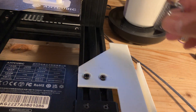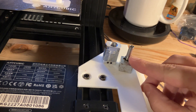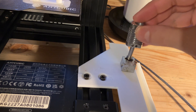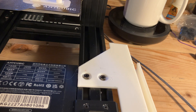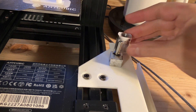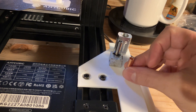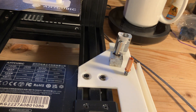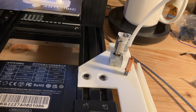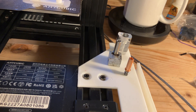Today we're talking about whether it's worth replacing the heat break — this bit here that sits inside your heat sink — with a bimetal heat break. The difference is that a bimetal heat break uses two different metals. This is the bimetal heat break compatible with this setup. More importantly, you get rid of the PTFE tubing that goes all the way down and touches the nozzle; instead it only sits just before entering the filament path.